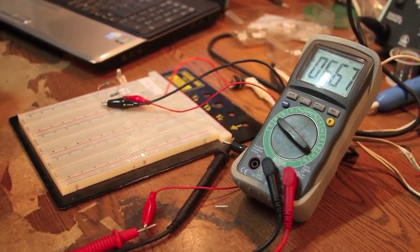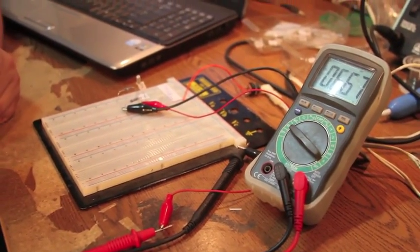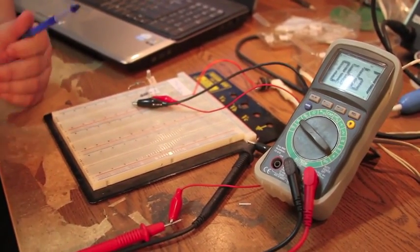Buying them together, if it's getting towards 70, is that still pretty usable? Well, the nice thing about that is we've got that trim pot in our Fuzz Face clone, and that trim pot is meant to kind of offset that difference. That's one of the reasons that trim pot is in there, is to offset any difference between the transistors and kind of help boost the fact that the germanium transistors are so erratic in their readings.